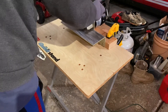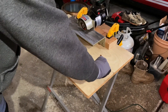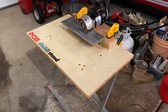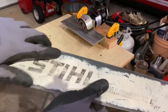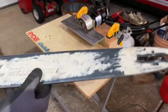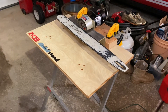You can see it's a pretty quiet machine. Balance is a lot easier now — we're pretty straight. This bar was in pretty bad shape when I got it; it had clearly never really been dressed. I usually use, depending on how much of an edge there is, either a file or a die grinder to take the sharp edge off so you get it flat. The big thing is to make sure you get those ridges off so that you have a perfectly square 90-degree edge.